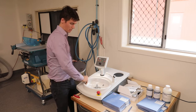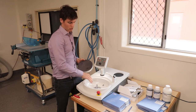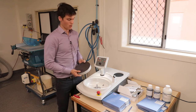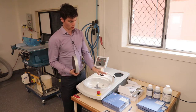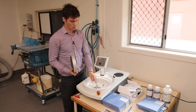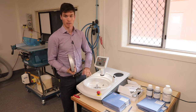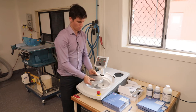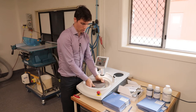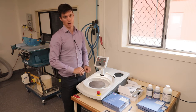There's a plastic guard here, which is simply to keep the machine clean. Something important: when cleaning the machine, make sure you don't turn the water system on when the disk is off, because it's not good for water to get inside the coupling area. When the machine is on and secured, the water will not get into the sensitive area.